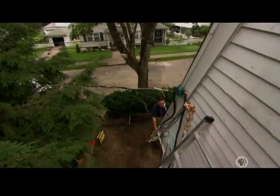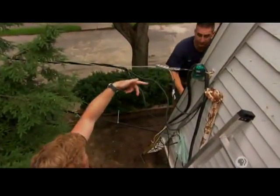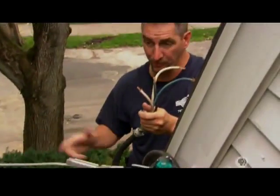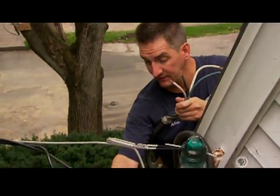Tell me what we're looking at here. What you see is we have the power coming from the utility company across to the building. We have the two hot wires and the neutral. This is still hot. I'm going to take these conductors that go down to the temporary power distribution box and connect them — one hot here, the other hot here, and then the neutral here.